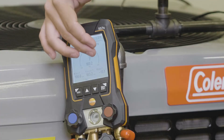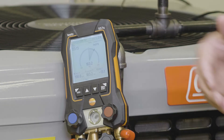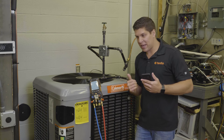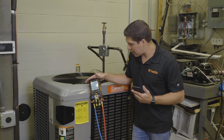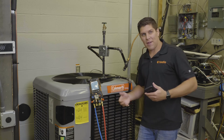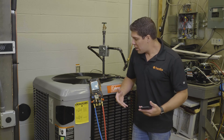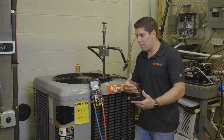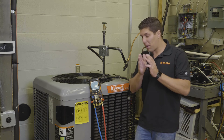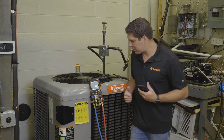As you can see, we have a delta pressure of minus 13 and a pretty wide opening of the graph. With the traditional old-school displays and the new digital technology, you're able to see that you've got a pretty wide opening — you may have a leak or a fitting that may not be completely connected. That's where you as a tech come in to diagnose the problem. If it's a skinnier pie, you should be okay, but that's strictly up to you.